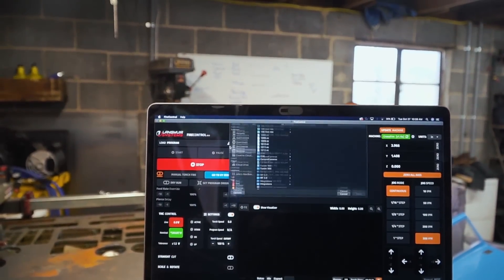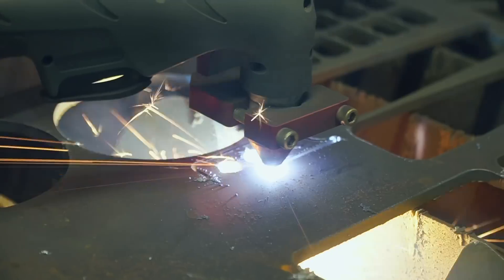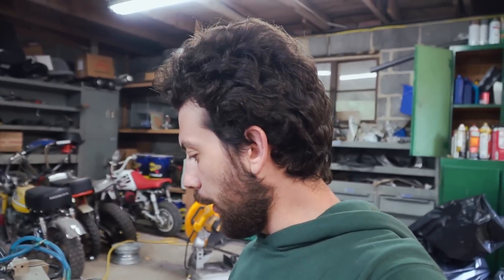I have my part designed with the three holes and I'm ready to cut it out. In case you're wondering why we don't have any water in that side of the table — on day one when I was learning to use it, I cut a small part without water thinking it would be fine. It blew a hole in the bottom of the table, and I have a new part to replace it with, I just haven't done it yet. The couple of prototype pieces are going to do the job — they're looking good — so I'll go ahead and cut out a whole bunch more.